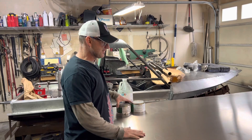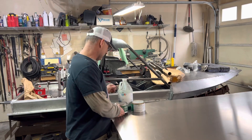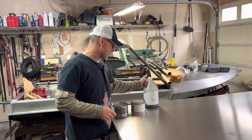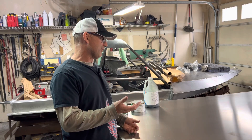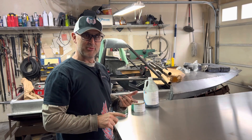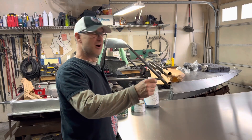The very first thing is to prep this aluminum. You got to put a wax on here. We're going to put two layers of wax on here and then we're going to put this release agent — it's not toxic but it's stinky stuff. It's a release agent that lets that carbon fiber pop off of there. Then we're going to put a two-part resin, saturate it, then put one layer of carbon fiber, more resin, another layer of carbon fiber, more resin.